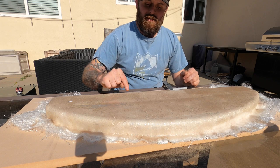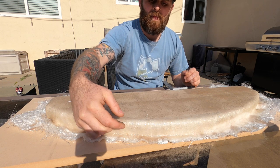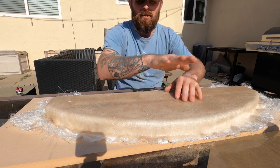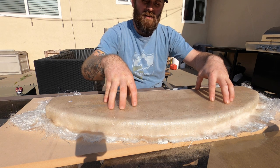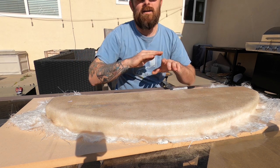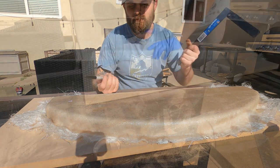So what we need to do is draw my line about an inch down. I'm gonna come an inch down off the top, and the reason I'm coming an inch down is because that's giving me a quarter inch of play when I lay my carbon fiber in there to trim back, because my panel needs to be 3/4 thick. So with an inch and that extra little quarter, if I don't bring the carbon up high enough, it gives me a nice area I can come back, trim up, buff out, and make it shine. So first thing we need to do is measure and come off the top an inch.